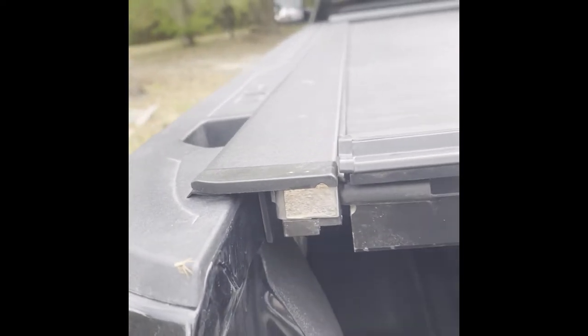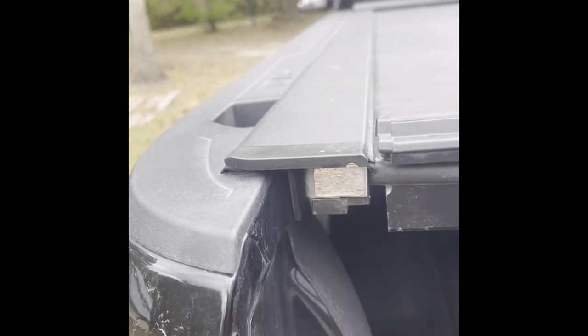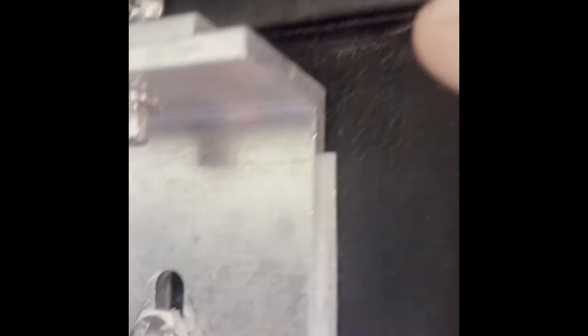So what I think is happening is going down the road with the flexing and the bumps, it's actually moving back and forth and the locks are ending up inside. How you fix this - and what I noticed right away - is there are adjustments. All you literally have to do is undo this screw and take a screwdriver, go on the backside, pry bar, work it up in there, and just kind of move it over to tighten it up.